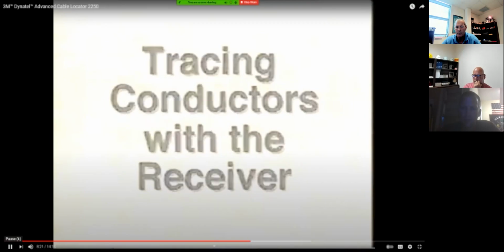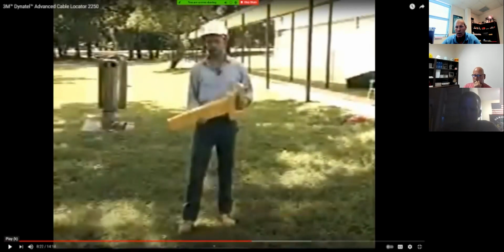So how do you know if you've located the right one? You don't. What you're going to have to do out there is, now typically companies nowadays do what they call a joint trench. So everybody's in the same trench. When you dig in your power, then telephone and TV cable follow along with you. That's the newer style of doing it right now.